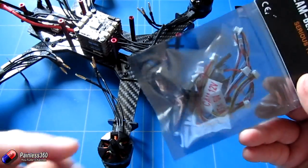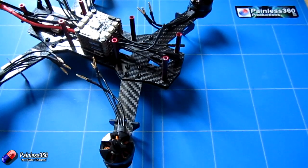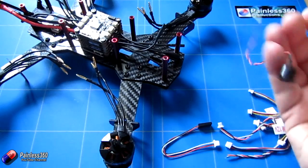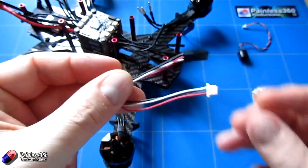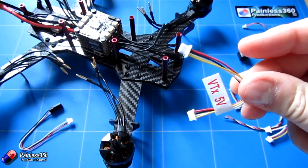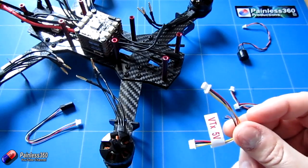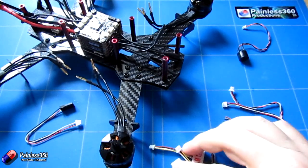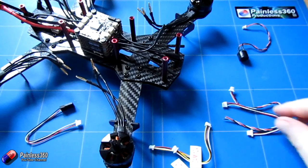To connect everything up we're going to need an extra little bit of stuff — this is the bag of cables that you need, so make sure when ordering that this is included. We get a buzzer, which will be installed in a later video. We have the connector for the receiver — the one we need to get the receiver talking to the flight controller. We have a cable for the 5V video transmitter, and cables to run the video transmitter at 5V and the camera at 12V. We'll talk about those in a later video when we set up the FPV system. We'll also put things like the TBS core on here for an on-screen display.